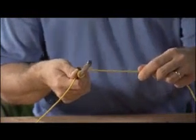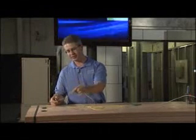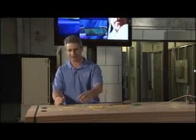If I put another turn on that mandrel, basically the signal is gone. The subscriber has no signal and is now calling the helpline asking someone to come fix their fiber service — not a good thing. Obviously a challenging environment, but there aren't many mandrels inside apartment buildings, so we'll show this in a more real-world context.